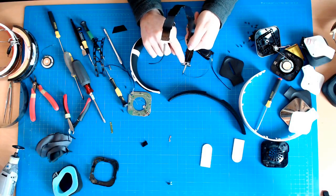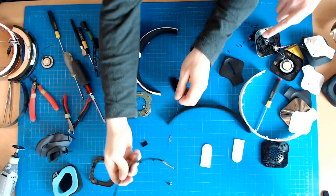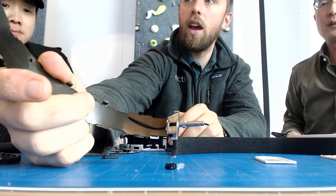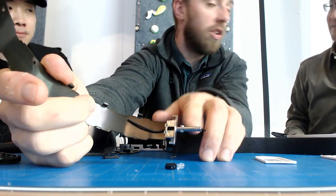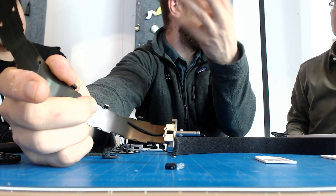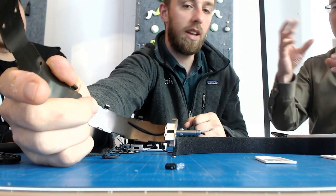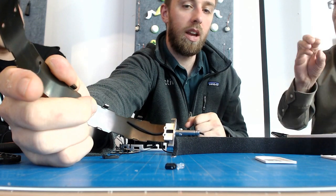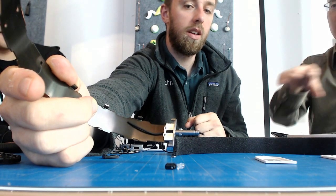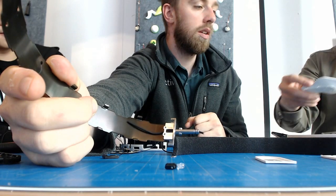Are these metal injections? Yeah, that's actually part of what made it work so well. Those are metal injection molded parts. Can we see that okay around there? Yeah. So these are metal injection molded, so everyone knows what we're talking about. It actually starts as a powder, molds it, and then we bake it afterwards. It burns off the resin, and you end up with a fairly high precision, high tolerance metal part that is more complex than your typical metal castings.